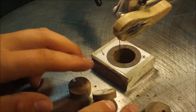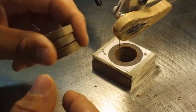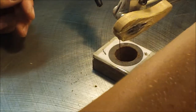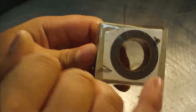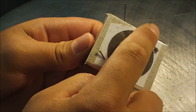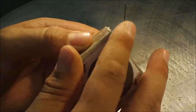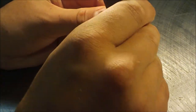Those can pop out. For the maple shaker it has the three pieces of quarter inch walnut. Now we can move to the outside of this. Since I stack cut, you have to drill a hole in the workpiece. That way if you enter from the side and cut it out, it won't break away — you might not be able to hold all three pieces. So that's why you tape it all together, use the nail, and then enter your hole to keep it all together and start cutting.